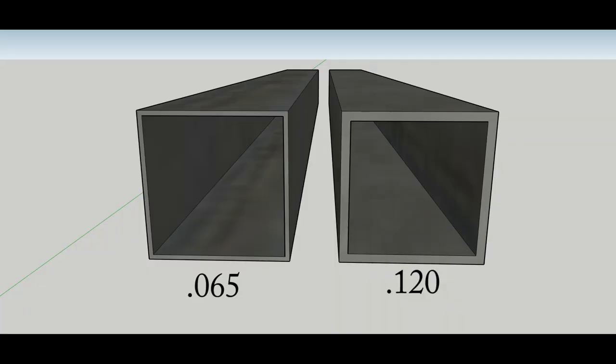While our attempt at bending the two inch steel failed, we did learn something. We got the arch we needed, so I was able to take that piece back to my metal shop and they could do it hydraulically. We also went to a thicker walled steel tubing — a 0.120 wall as opposed to the 0.065, which is really kind of thin to be bending anything with — and they were able to bend the steel the way we needed it to fit the gate.